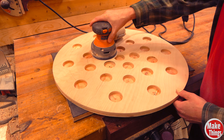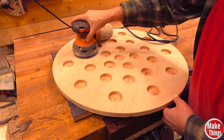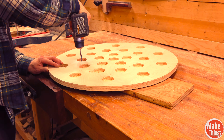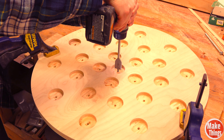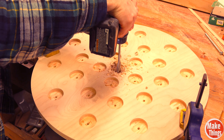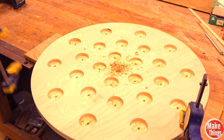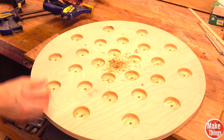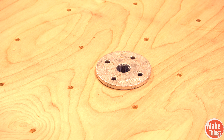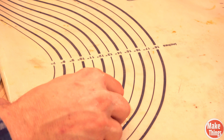After drilling and sanding the entire thing down, I used a quarter inch drill bit to drill the 25 outer holes. The 26th center hole will get a one inch spade bit. This hole will be large enough to fit a 3/8 flange that you should very easily be able to find in your local hardware store. To attach the flange, I used epoxy and four screws.